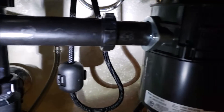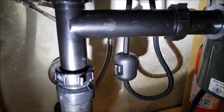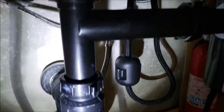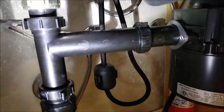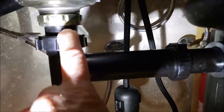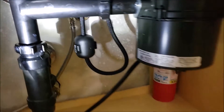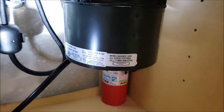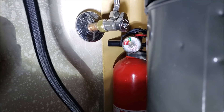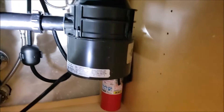We told them we'd replace it, and we did — brand new one-third horsepower disposal. The telescoping kit from the disposal to the p-trap was also damaged; they had used metal nuts and cross-threaded some of the adapters, so we replaced all of that. We kept the original p-trap since it was in good shape, but the T, the extension piece, and the plastic nuts are all brand new. We also replaced the cold shutoff valve — the old one was a multi-turn that wouldn't shut off all the way, so we installed a new brass craft quarter-turn shutoff valve.